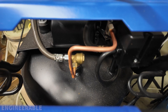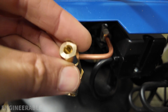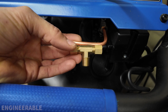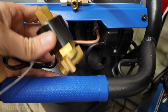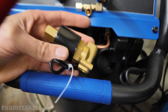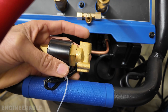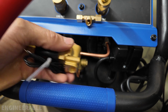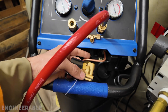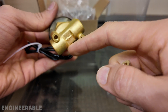To allow the compressor motor to start up again, I'm going to T into this pressure relief line. I found these quarter-inch copper tube fittings that go to a quarter-inch NPT, and I'm going to T into that using this fitting. Then I'm going to use this normally open solenoid valve, attach it to that fitting, and wire it in parallel with the compressor motor — such that while the compressor motor is running, this valve is always staying closed. When the compressor motor shuts off and power is removed, this valve opens and unloads the pressure. This setup is called an electric unloader valve.